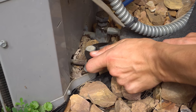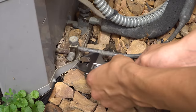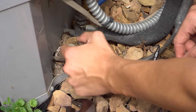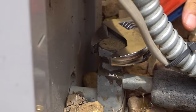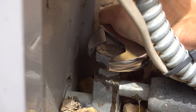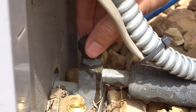These are three-way valves. This one opens pretty easy. If you have to apply a lot of pressure to take these caps off, I would recommend also holding the whole valve with another wrench as you're working on it, so it doesn't get twisted off — the last thing you want is to cause a leak. You want to take both of these caps off because that's what you're going to use inside. But these are coming off pretty easy.